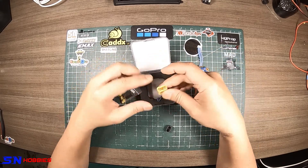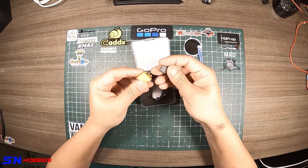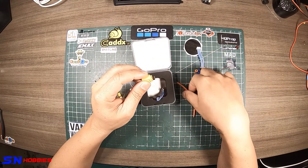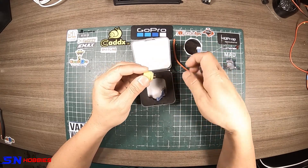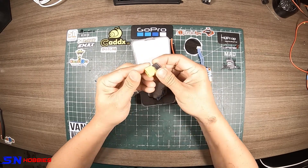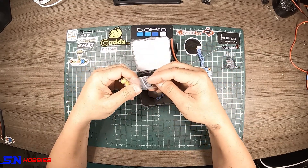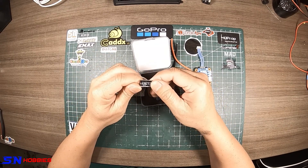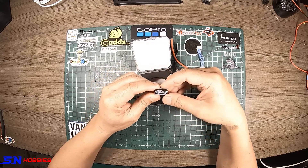It came with a spare connector but it's the same size. You've got this type of XT60 — once you put these on, you just cap it, it's cleaner. You also have a capacitor — what's the rating on this one? 35 volt, 560 microfarad. That's more than enough for 6S.